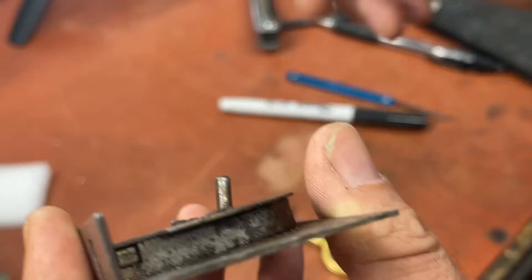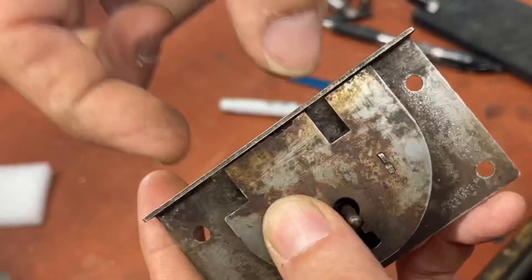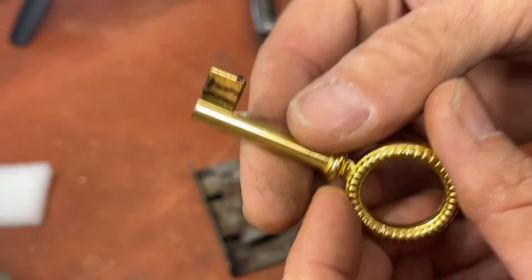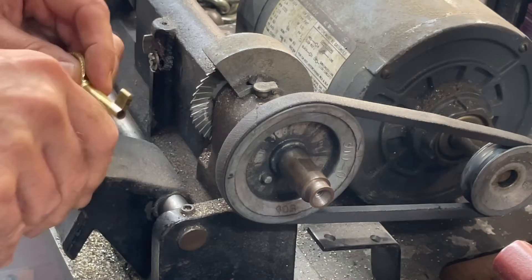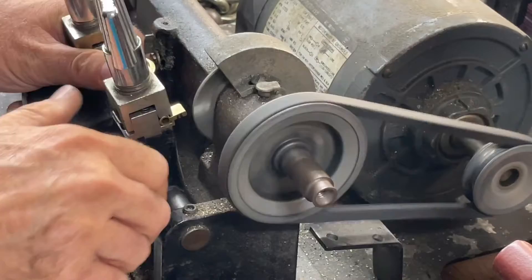The bolt is on this side, towards the head. When you turn the key it throws a bar across, and the latch has two notches — it goes down into it and the bolt throws across. I'm going to go ahead and start cutting this all down. I'm going to use my cutter for this because I have the ability to — you could always use files, but I'd like to save a little time. I'm going to go ahead and cut the back off to make it fit in the lock.